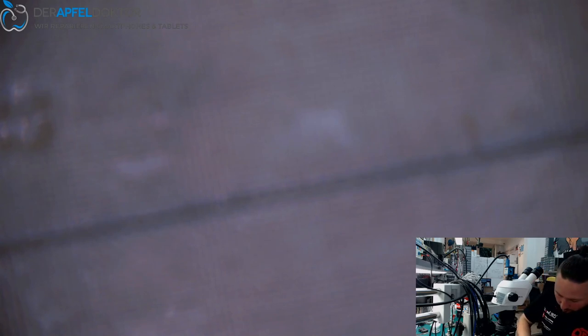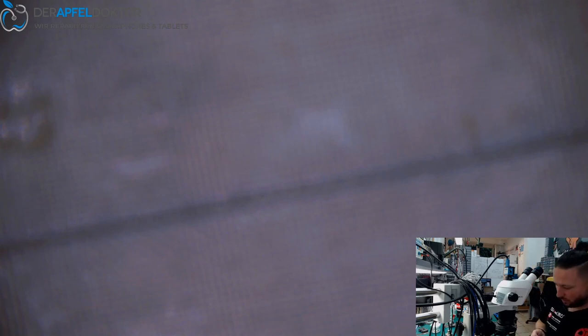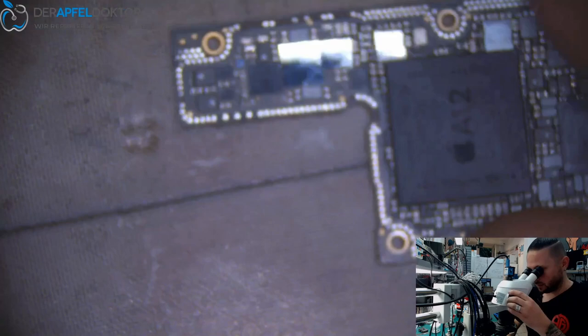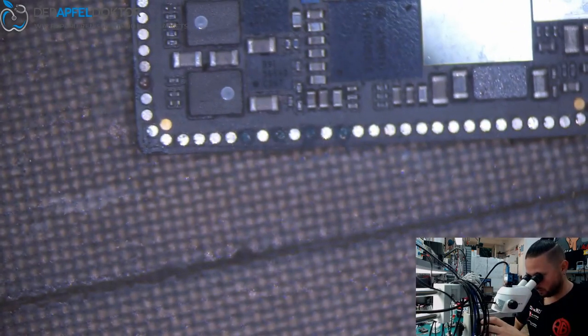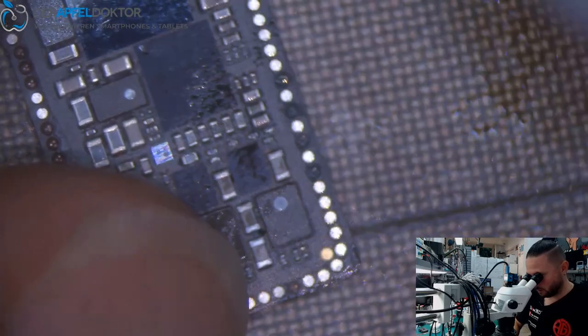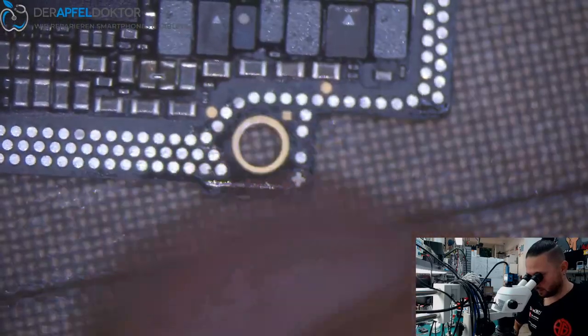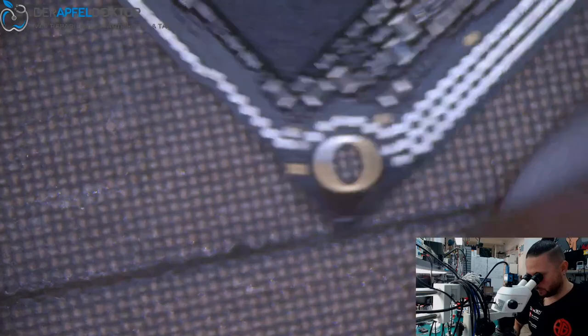I don't want to take a lot of readings now for checking. So I think if the customer says he only got some audio problems, perhaps he hadn't realized some other problems. So I jumpered the lines, the pads, which are really important. You can see they all have contact here. Yeah, this is pretty good. Controlled rest, this is only ground, not a problem. No other ripped pads, no dirt. Clean it, here is ground too. So I think we can now get the board back together.